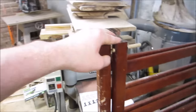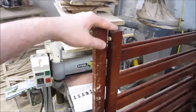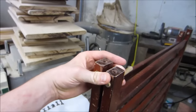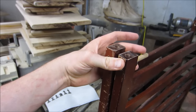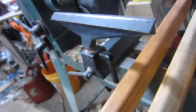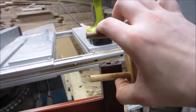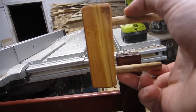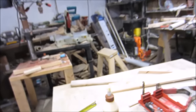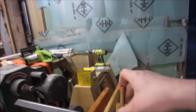These pieces are about 4 feet and I realized I don't even have an 8-foot wall for mounting them. So I'm going to have to create a center hinge so that they'll be directly lined up and they'll have that center hinge for folding up when it's not in use. I ended up fabricating these, which will connect the hinges, and I'll put some cotter pins or something on the other side with a washer for spacing. In this case I actually did use some Gorilla wood glue — some PVA glue — and that should connect nicely as a hinge.